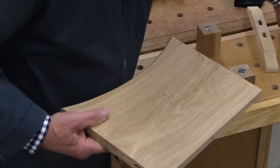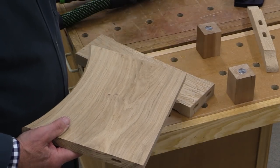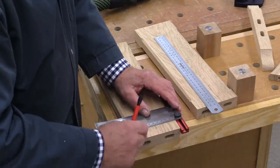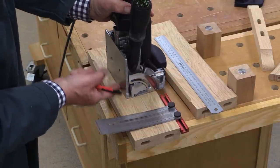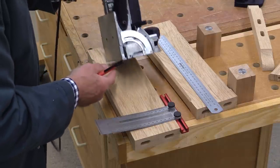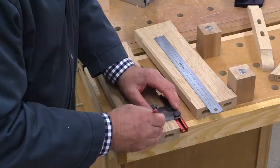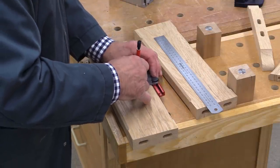When it comes to doing the dominoes in here, because this is quite wide, far too wide to use the height adjustment on the machine, I'm going to have to tackle it vertically. The width of this is 108, so the middle is at 54. But when you use the domino vertically, this plate here is 10 millimetres away from the center of the cutter. So in order to do this vertical cut, I need to know where this should be. So I take 10 millimetres away from 54, I end up with 44. And I'm drawing a line across here, 44